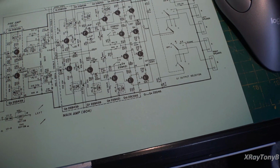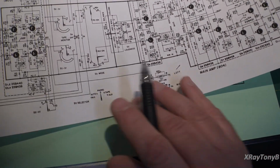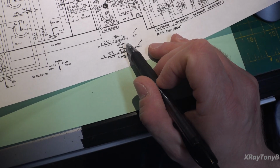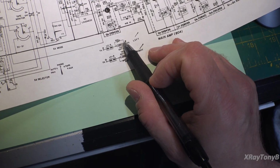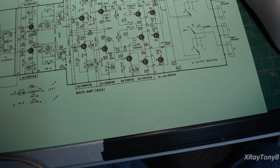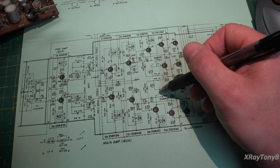And if I show you the schematic for that, that represents this little circuit right here, which is one of these little diode networks in line with an SDT-06, which I can find no information on, that is shunted by a potentiometer, a 500 ohm pot. And those things, if you notice, pin 1 and pin 2 are placed right in this point right here on the schematic.